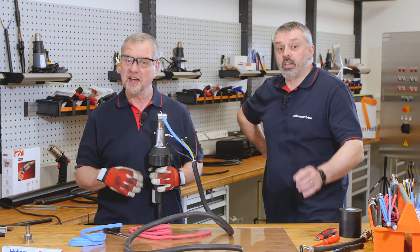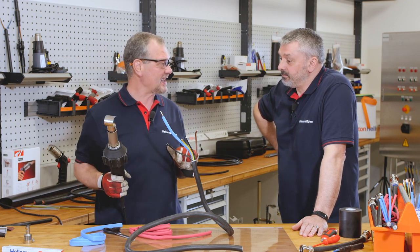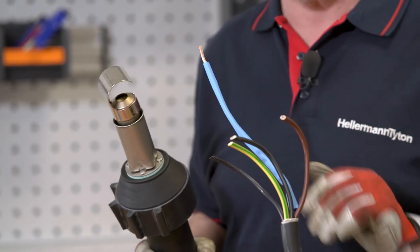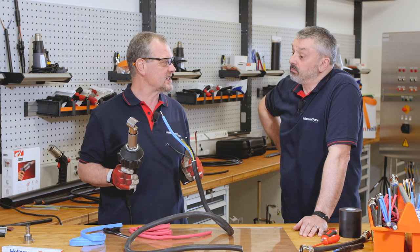We used the deflector nozzle on our SE28 previously — if you've not seen that, please click on the link below. I'll just leave it a second to warm up. Why do we do that? To start a nice uniform shrink, because we don't want hot spots and cold spots. This TF21 actually shrinks at 90 degrees Celsius.